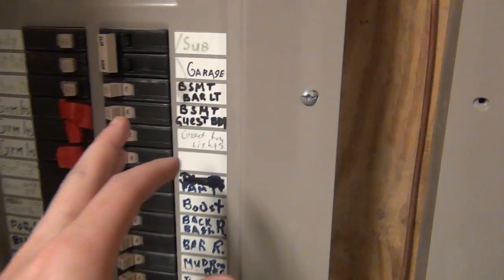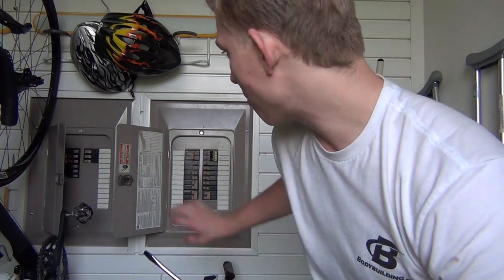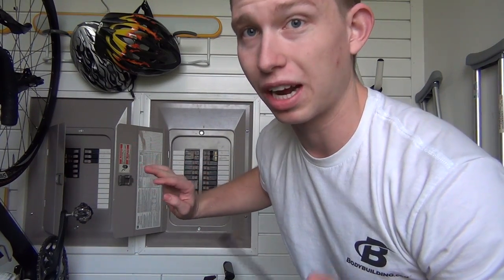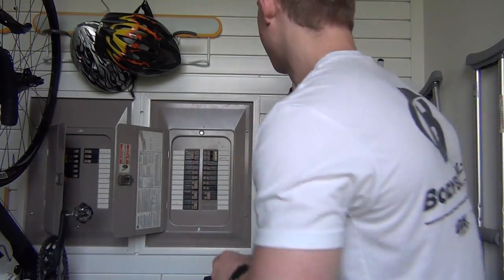The real reason we're down here is I need to shut off the power to my apartment. I come over to these main breakers - this is where the power filters into the house. It goes into these boxes, and what I need to shut off is the apartment. That's this sub-panel. Boom, it's shut off. Now I should have no power in my apartment and I'm free to work on anything. I want to stress the importance of knowing the power is off and understanding you've shut everything off before sticking your fingers in the panel. I don't touch any of the actual electrical in the panel - I take the cover off and test it with a multimeter, which is a tool you use to test for voltage and amperage. You make sure the circuit is completely dead.